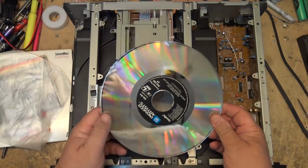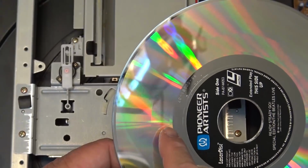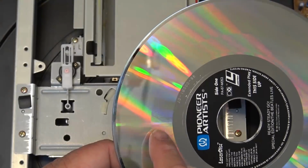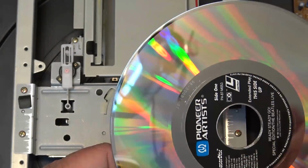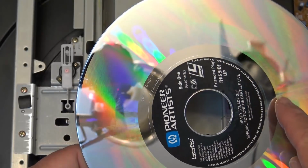and then you can actually see the individual frames. I don't know if I can get a better shot of that or not, but you can distinctly see there's the sync pulses, and the color burst would be in here as well. And then here's your individual frames. These are the individual lines, right? As this rotates, there'll be 262 lines going over to here.